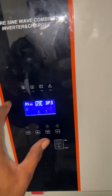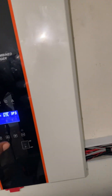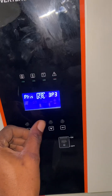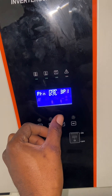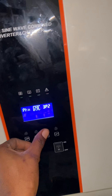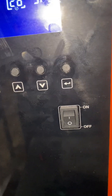This is three phase. Before you can make this system three phase, you have to have at least three 10kVA inverters to achieve that. Since we are not making it three phase — we just want single phase but 20kVA — we want the inverters to work together and combine both powers together.